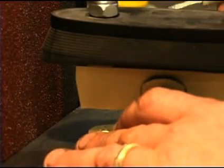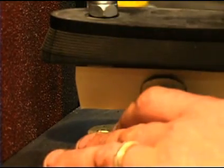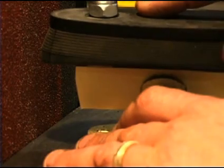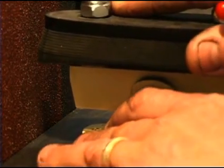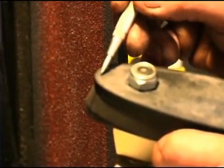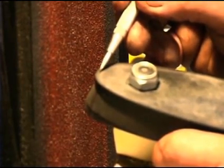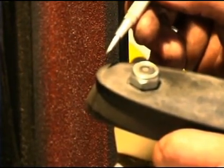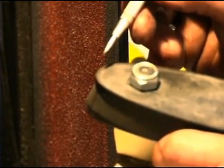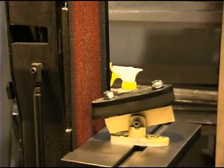Locate your angle of toe. Set the pad jig parallel to the proper angle and begin grinding. Grind to within 1/64 of the scribe line, leaving a small amount of excess on the ends. Be careful, less surface area will grind faster. We'll start grinding with the 80 grit dry belt.